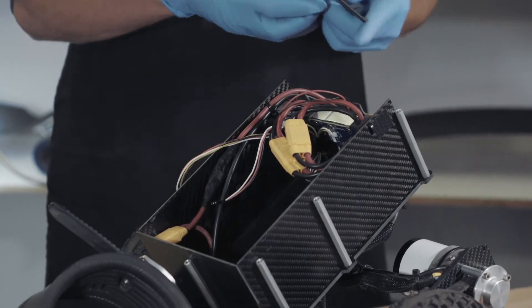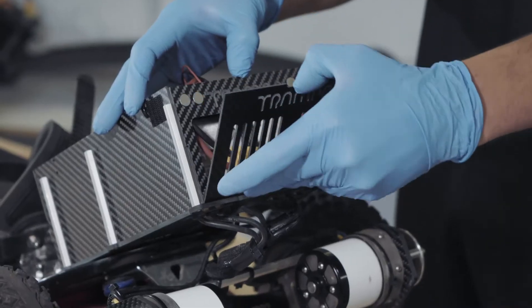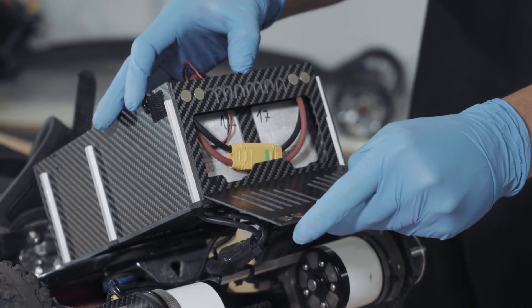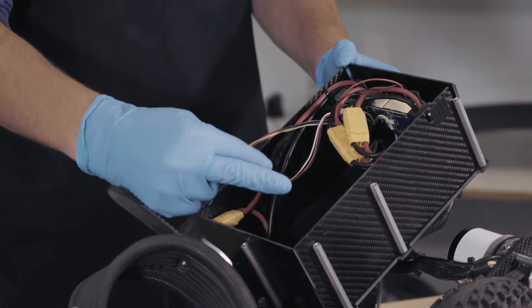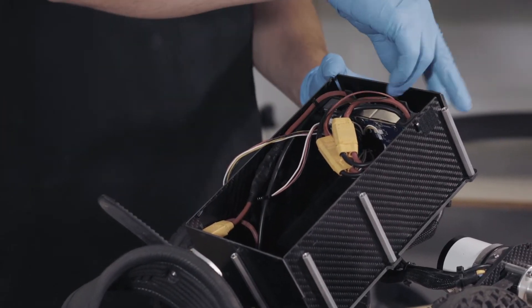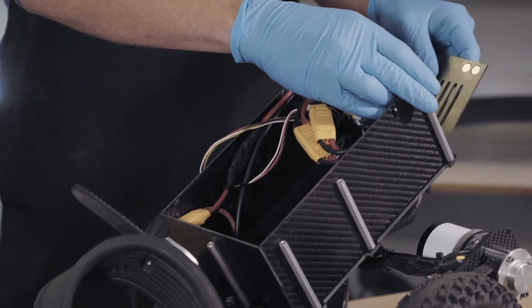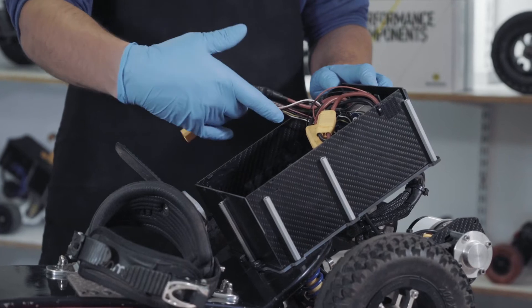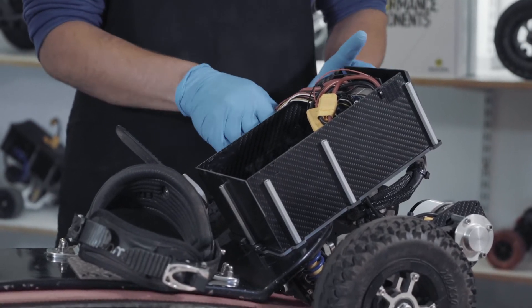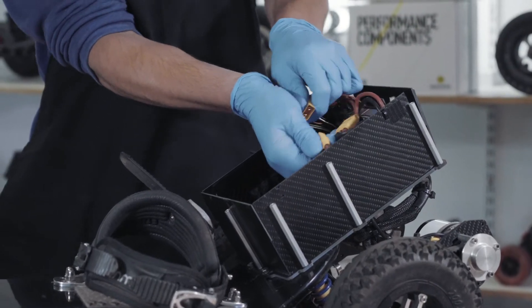Some of the features on this box: we now have a magnetic back plate which covers the loop key. So this here is now your loop key — that's all covered at the back. The balance cables will come from the top of the batteries, over the back, and into behind that compartment so you can access them easily. The last thing to do before we start getting our batteries ready to fit is to hang all these cables out of the way and unplug the two VESCs, just to give us maximum room.